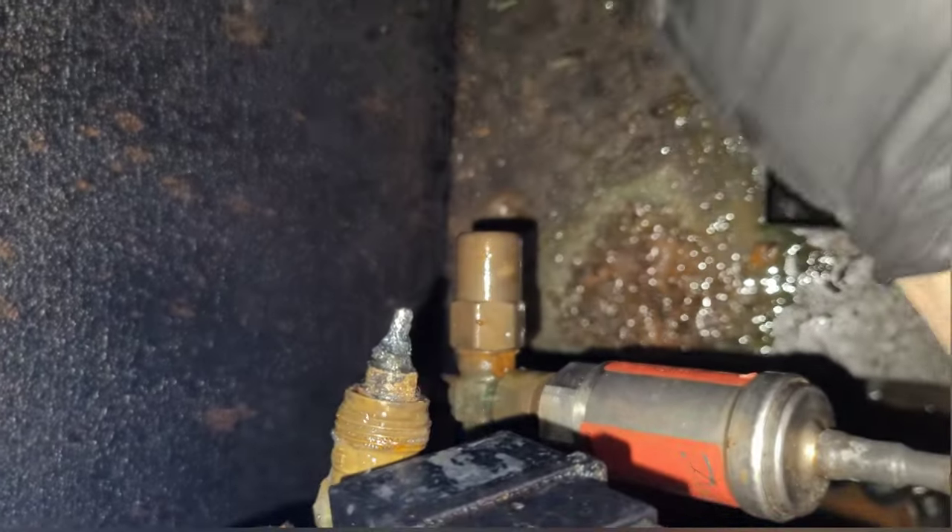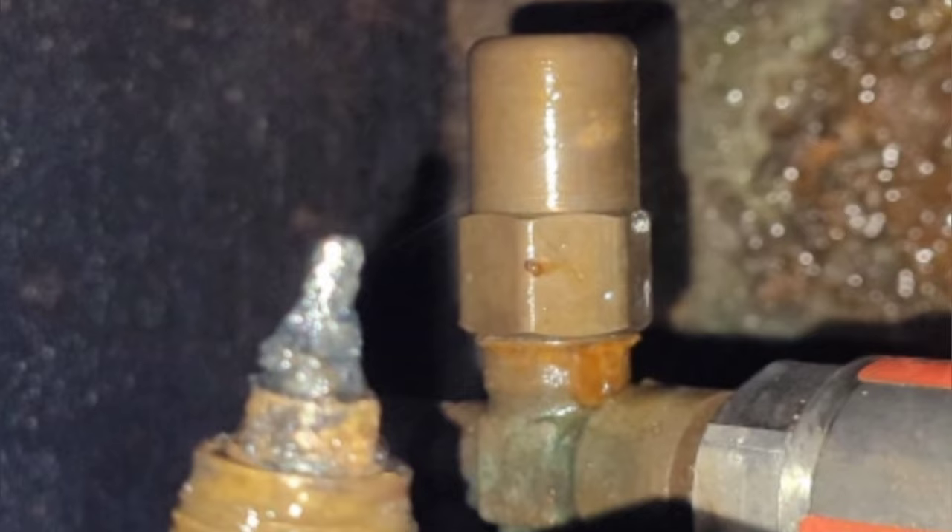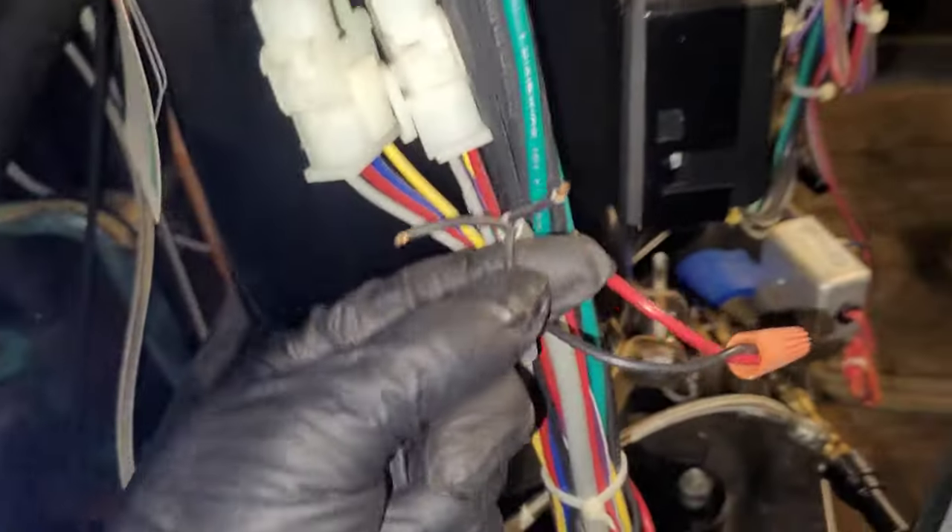Normally this would be as simple as closing the access valve, but this one's all screwed up so I'm going to have to do a full pump down of the rack. And it turns out this switch isn't even hooked up — someone bypassed it and didn't follow up on their job. So I'm ready to pull this thing out.